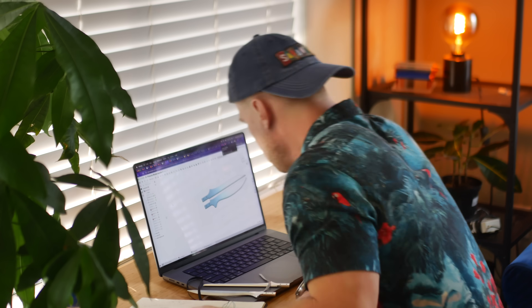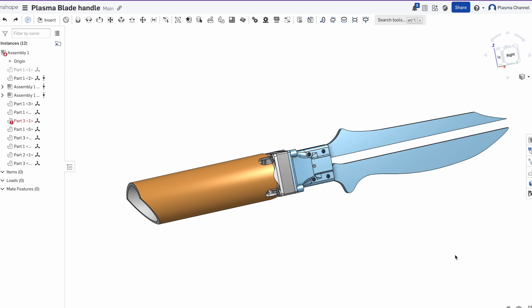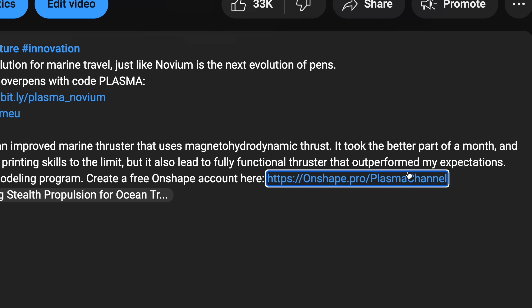This gave me enough material and information to start designing the knife handle, so I got straight to work 3D modeling the handle and all the other components. I used Onshape, and the process went really smoothly — two mounting bolts for each blade, a fan compartment with shroud to focus airflow between the blades, and a cylindrical handle with room for the battery and high voltage board. I always use Onshape because it's really easy to work with.